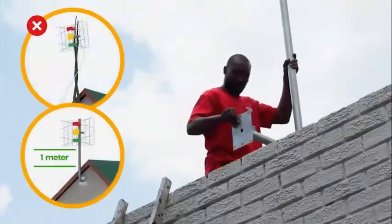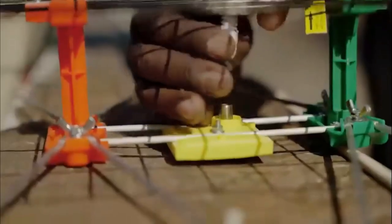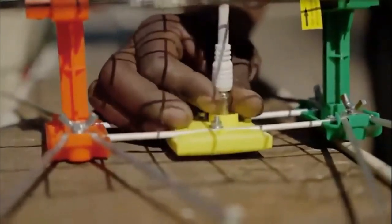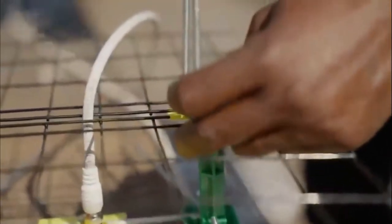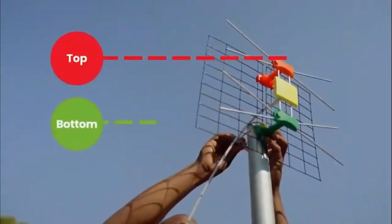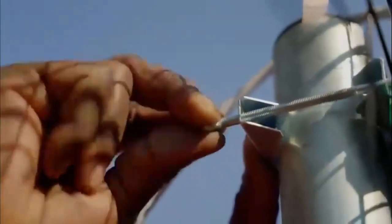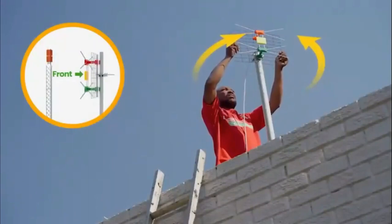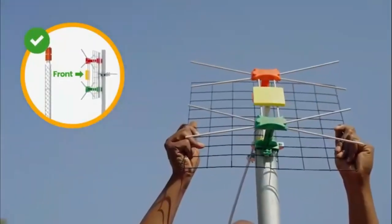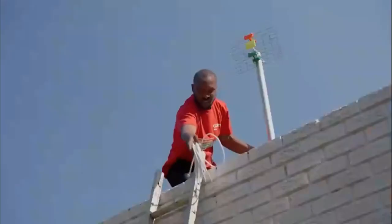Now, install the pole you have purchased as high as possible. Next, connect the RF cable to your antenna and make sure the cable runs behind the steel grid. Using the indicator sticker as a guide placement, place the U-bracket through the middle of the antenna. Then, mount the GoTenner to the pole like a traffic light with red on top and green on the bottom. Use the brackets provided to fasten it in place. Aim the front of your GoTenner towards the transmitting tower to ensure you receive maximum signal. You may want to look at your neighbor's antenna as a guide.